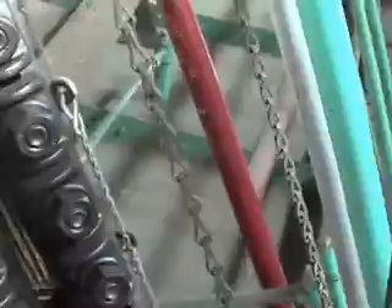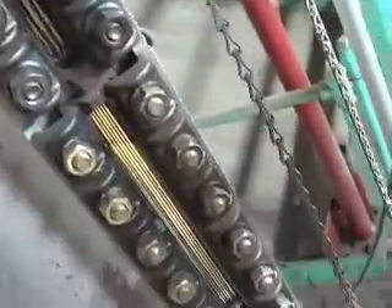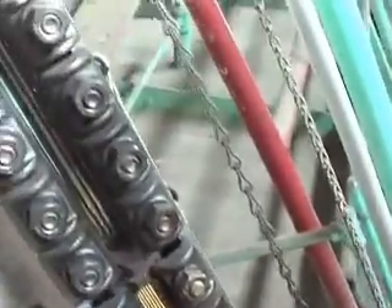Sorry I didn't bring my flashlight. Here's the sight glass. I'll be taking this apart with the unions here and taking it down to replace the glass in there — it's real thick. That's where your sight glass is to keep an eye on the water level. We replace that every year.